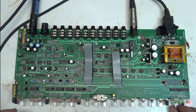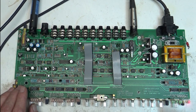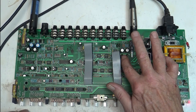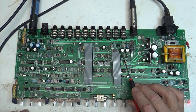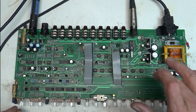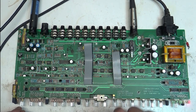Now it's working just fine. It's got nice good specs — it's one of the really old ones, so the specs aren't the grandest in the world, but they're pretty good. Quick tip: if you have one of these with absolutely no audio out, but your input and output level lights on the front are lighting up, take a look at these two JFETs. They're J108s — I put in J113s, which are a direct pin-for-pin replacement and work great. They're used as a switch, so the exact part doesn't matter much. These components appear in the schematic but aren't properly cross-referenced.